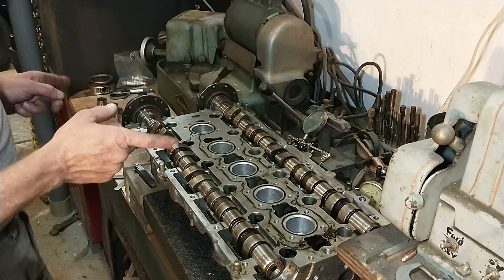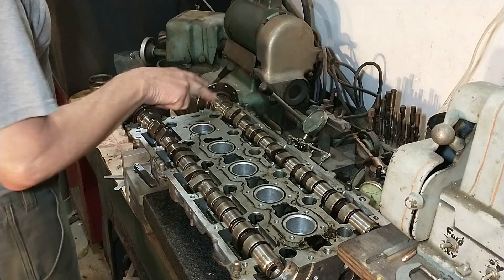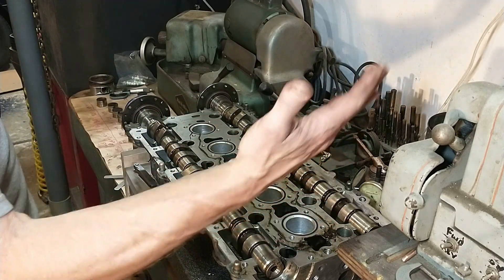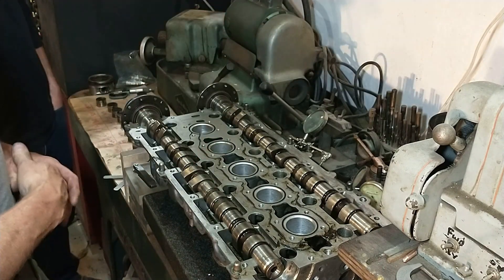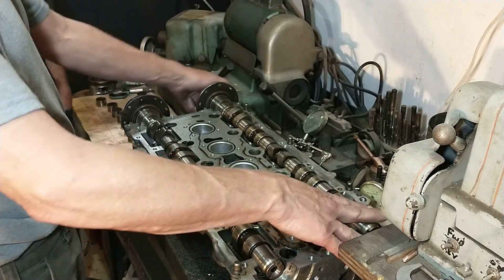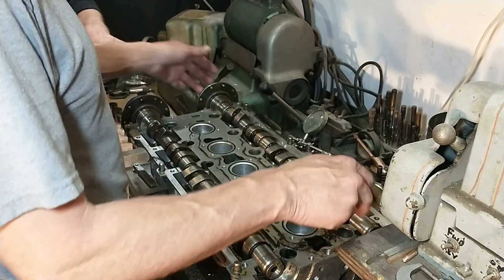Let's get down to measuring some of these buckets. We've got two exhaust valves for each cylinder, and if we had all the buckets in here, the valves we're attempting to open could be lifting up on the cam. The easiest way to know you're getting this right — and the beauty is we don't have to tighten or loosen anything. These Volvos are actually super easy to adjust the clearances on.